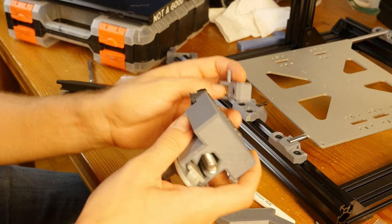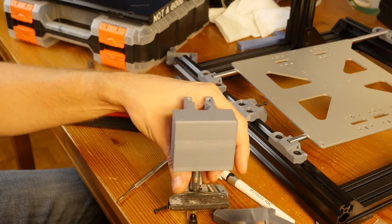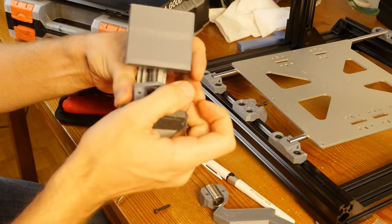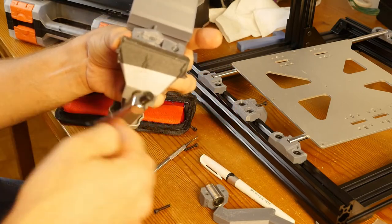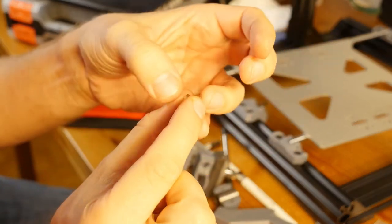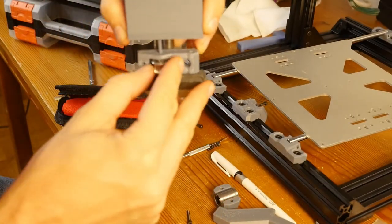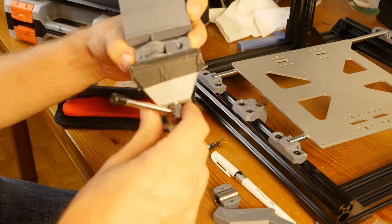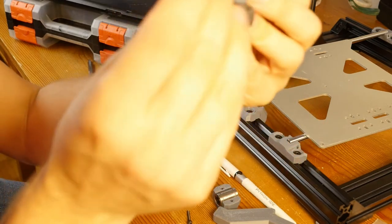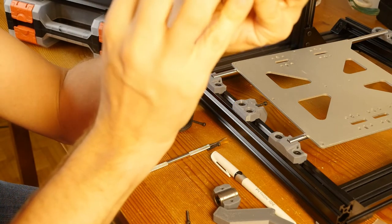So I'm gonna use my vise again. It appears to be big enough, so first I'm not even going to put the sprocket in. I'm just gonna tighten this so everything is kind of held together. In this case, the idler part has a bearing inside of it, so there is no need for the internal piece to spin. If it doesn't move, it's totally fine. So I am just applying a little bit of pressure that pushes the pin through, and now I'm just kind of sliding in the idler bit just in the right spot, I hope.